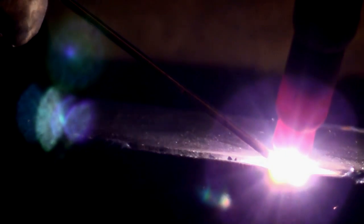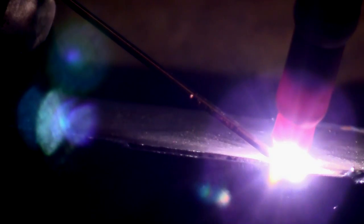I'll try to feed some 1/8 inch filler rod into it so you can see what happens. So — 60 amps, 1/16th inch tungsten, and 1/8 inch filler rod. Good lord, it's like welding molasses. It takes about three seconds to get that filler rod to actually melt.